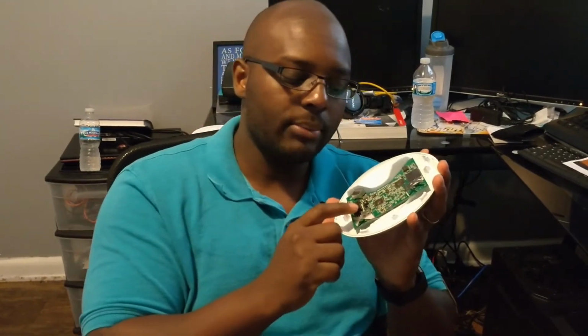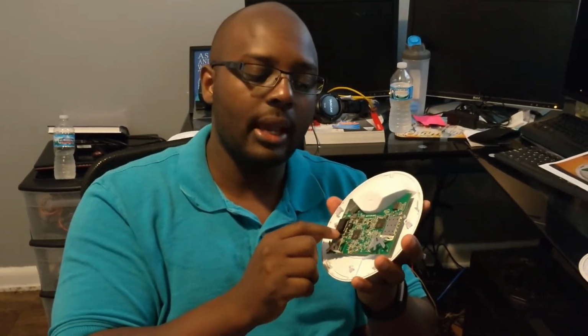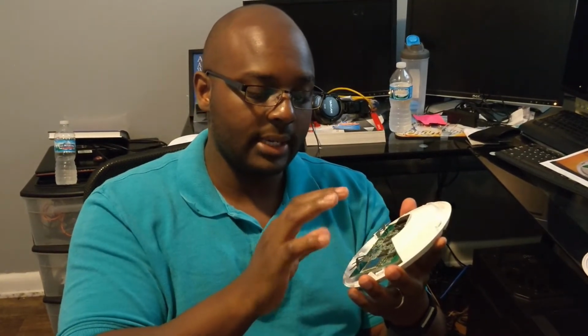The reason why you want to replace it, which you just solder, is because the next time you do the same thing without the TVS diode, it will burn the whole PCB, and you don't want that. Now, if you're careful, then you can get away without replacing the diode, but that's up to you. But for me, I'm waiting for the diode to come in so I can solder it back and plug this baby in and start using it. There's a different video that I took earlier, to make sure it was testing. I didn't have anything else to play with, so I guess I just have to show you what I have.